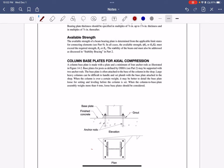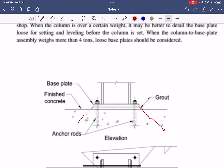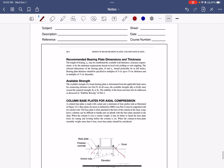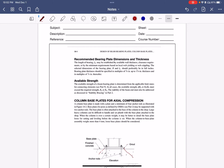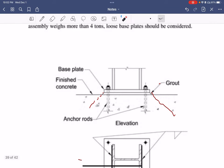Today we're going to be talking about base plate design. If you don't know what a base plate is — at the bottom of your column you'll have a plate, and the plate is there to distribute the load onto your foundation. The base plate will be welded and it would typically come with the column; in my experience, 99.999% of the time these two will be connected.